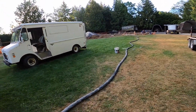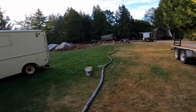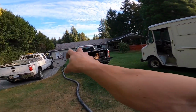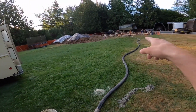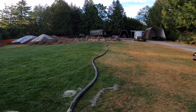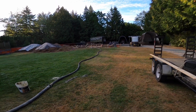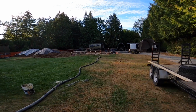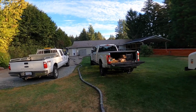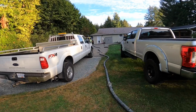The best way to do this, because we have the Milwaukee compressor, would actually be to push this sponge about 2 hoses from the end, bleed all the air off, break that compressor off, bring it down 2 hoses from the end, and finish it out just blowing the last 2 hoses out independently. The reason why, 2 hoses, not a lot of stored energy, way less potential for a catastrophic explosion at the end of the line. If you're using the truck's air system, you would need to have a couple 100 feet of air line to achieve this. So with the Milwaukee, it is very easy to do it that way.